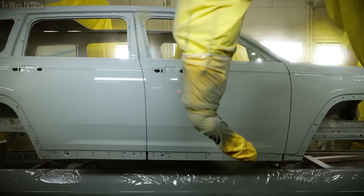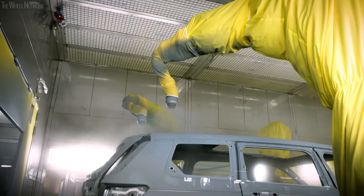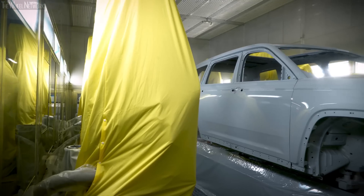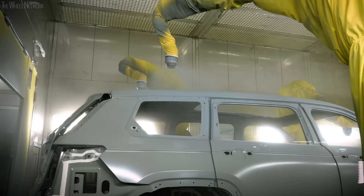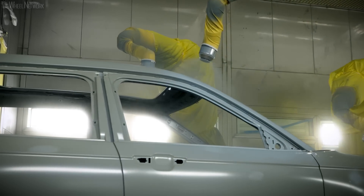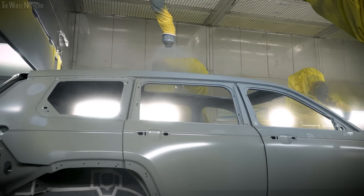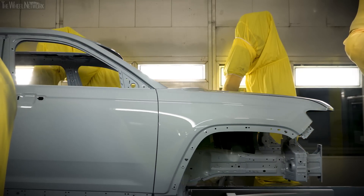Then we put our prime layer on, our base, and our clear. Primer is right in the middle of the entire paint shop. A nice even layer of primer allows our base coat to adhere to something smooth and flat, and that durability protection is important for long-term viability. In this booth we have eight robots — six always functioning at a time — and all six put paint on 100% of our cars. Further downstream, we have our two-tone booth, which puts a black roof monocoat on about 40% of our cars.